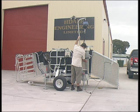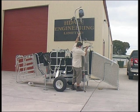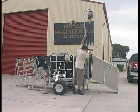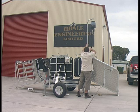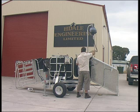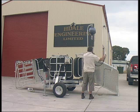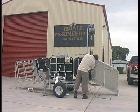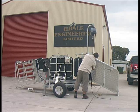Attach the crutching machine to the dagging pole and attach to the sheep handler. Attach scales to the upstand on the left hand side of the machine. Attach the load cell cable to the scales. Also attach the battery cable and the 9-pin draft controller cable to port 1 on the scales and on the battery of the machine. Turn the power switch on. You are now ready to start weighing.